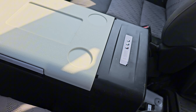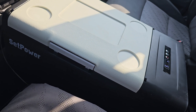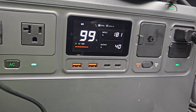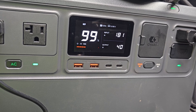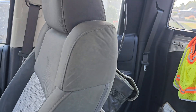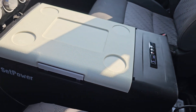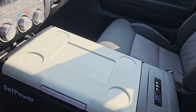The cool thing about this system is the hotter it is, the more the fridge runs — but the hotter it is, that normally means the sun is out and shining, so I'm drawing in a lot more power. Earlier today in full sun, I was pulling in about 185 watts from my 200-watt solar panel, which is pretty good. I'm running 20 feet of power cable from the panel to the battery, so there might be some loss there, plus general solar efficiency — none of them are 100%.